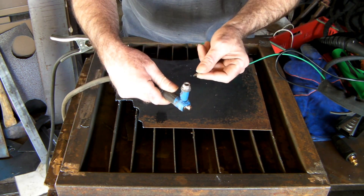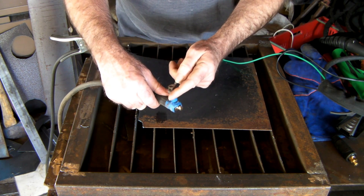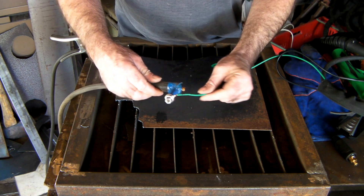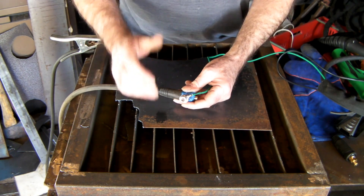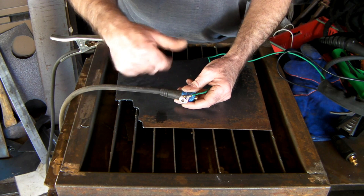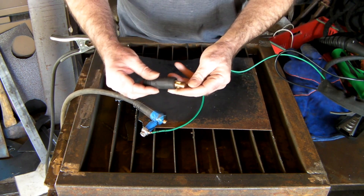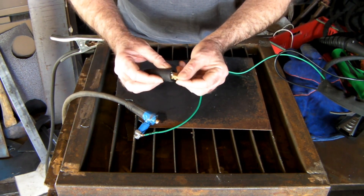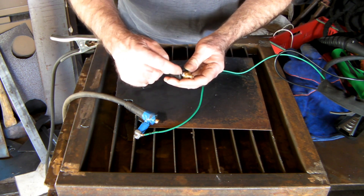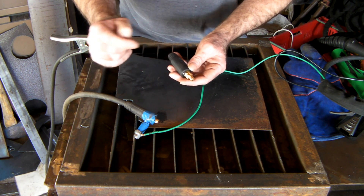This modified earth lead plugs into my machine and I can just put the extra wire from the pilot arc torch onto it right at the machine. It works fine — gives me the instant cutting power I need to get a flame coming out of the torch, and then as soon as it hits the steel it reverts straight back to the torch. I'll put a link below on how to make one of these plugs — it's really easy. It's just a generic plug that fits most Chinese machines, with a small bolt added.